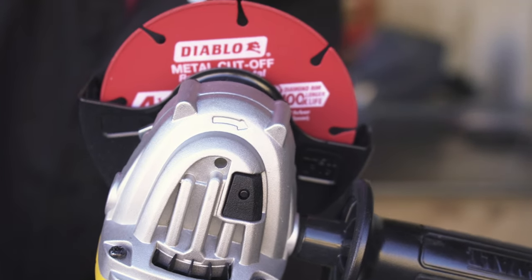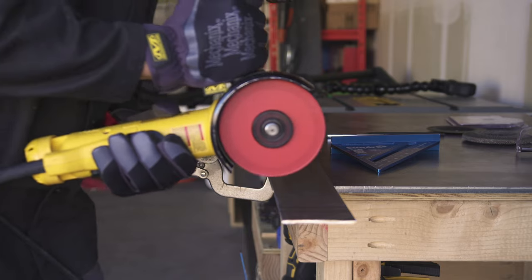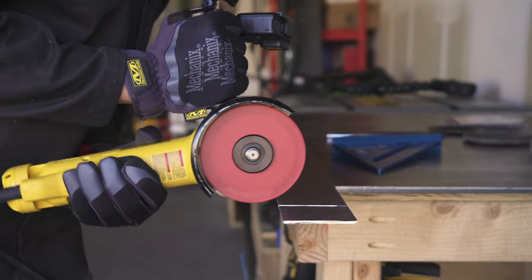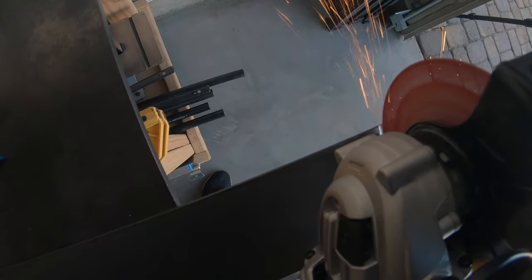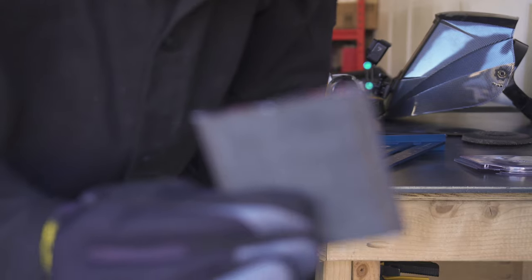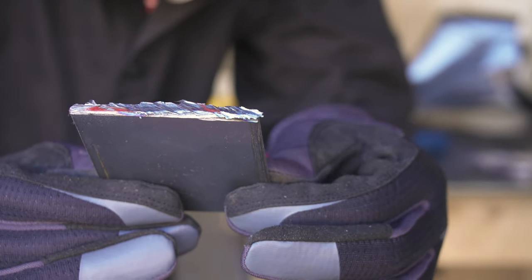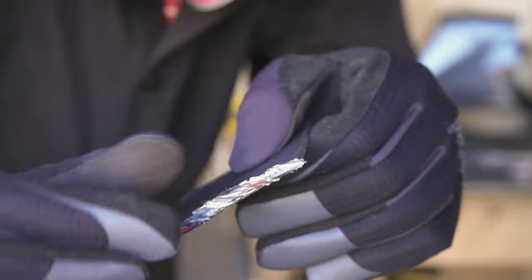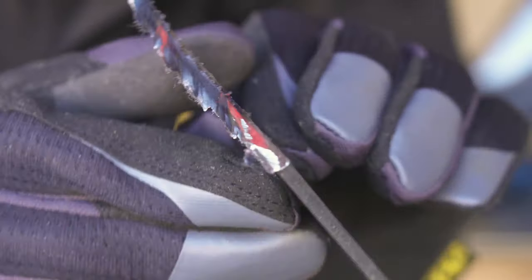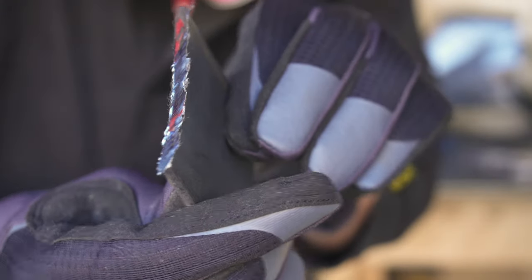Here's the other side of it — made by Diablo. Just looking at this disc inside the tool, it definitely looks intimidating. All right, the very first cut from the diamond metal cutoff disc — it's kind of ugly actually. There's a lot of — I think with plasma cutting they call this dross — but yeah, it was ugly. I think I was maybe holding it at an ugly angle; I couldn't really see it that well over the grinding disc. So let's try this again.